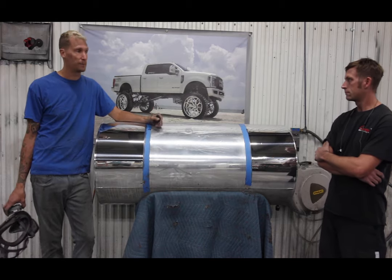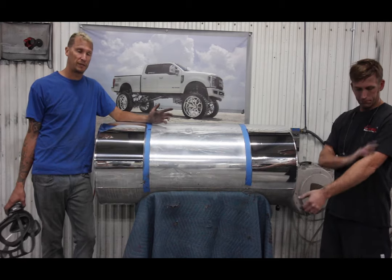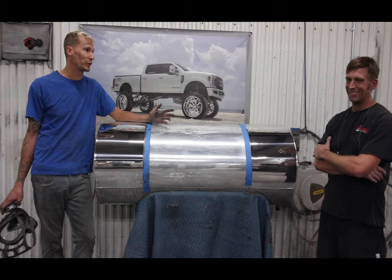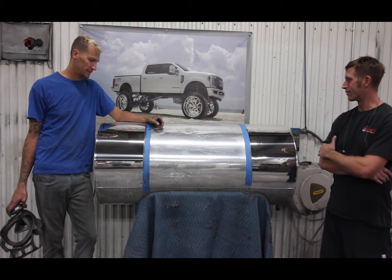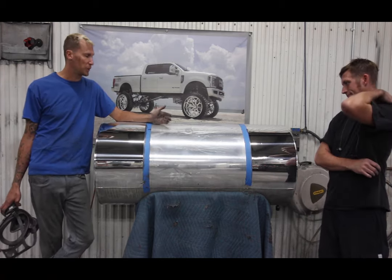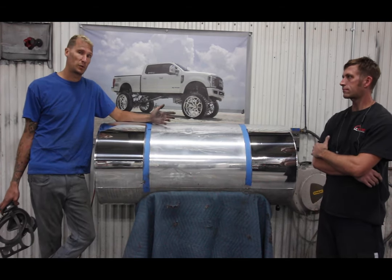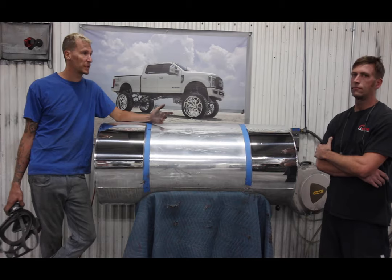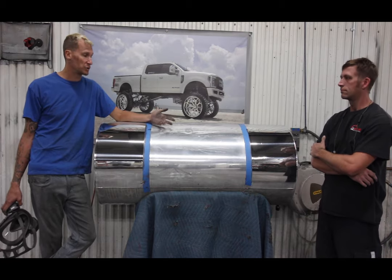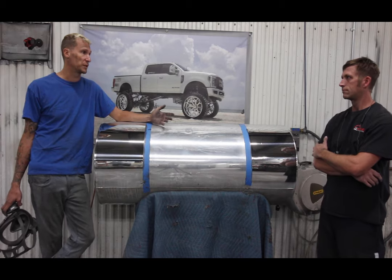And especially when you sand, anytime you sand something, it takes you twice as long to cut it. And the variable takes you triple, four times as long to cut it. It's extremely long. And on a variable, a lot of times I find myself having to jump up in stiffness too. Like if I'm working on something that's sanded and I go to buff it out with a 6,000 RPM grinder from something that's sanded, I jump straight into an orange buff. I don't know about yourself, but I always jump into an orange buff off of something fresh sanded.